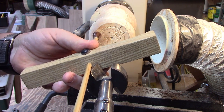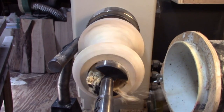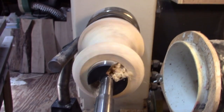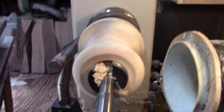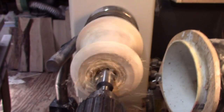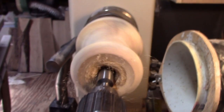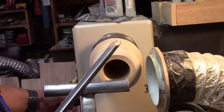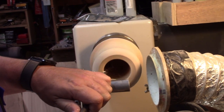I'm using a two inch Forstner bit and my depth finder. I'm aiming for about a half to three quarter inches from the bottom. You can see my Forstner bit was slipping in the drill chuck a little bit. Just keep your lathe nice and slow — I was about 280 RPMs here. That helps keep from overheating your Forstner bit, because if these things get overheated, they're no good anymore. That's got us all the way down to the bottom.